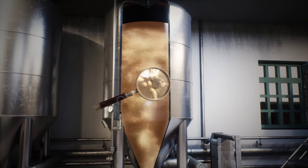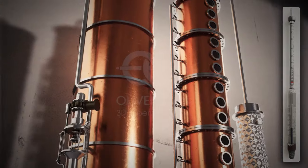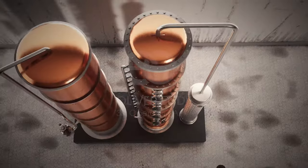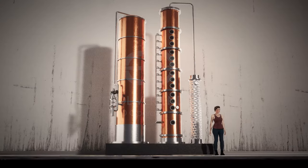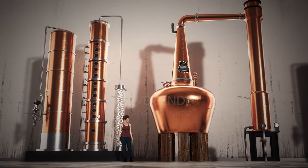The resulting liquid has an alcohol content of 6 to 10 percent by volume and can now be distilled. There are many different distillery types, although column or continuous distilleries are better suited to the production of vodka. For the production of Scotch whisky, on the other hand, mainly pot stills are used.